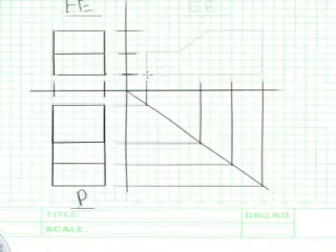We have a base of 55mm for the end elevation, a height of 15mm here — the projection line will serve as a guide, and on this side it will be 30mm. The top of the figure is a horizontal length of 25mm. Avoid the slope and start from here with a horizontal line, then connect the two points to form the slope. Remember to label your end elevation.